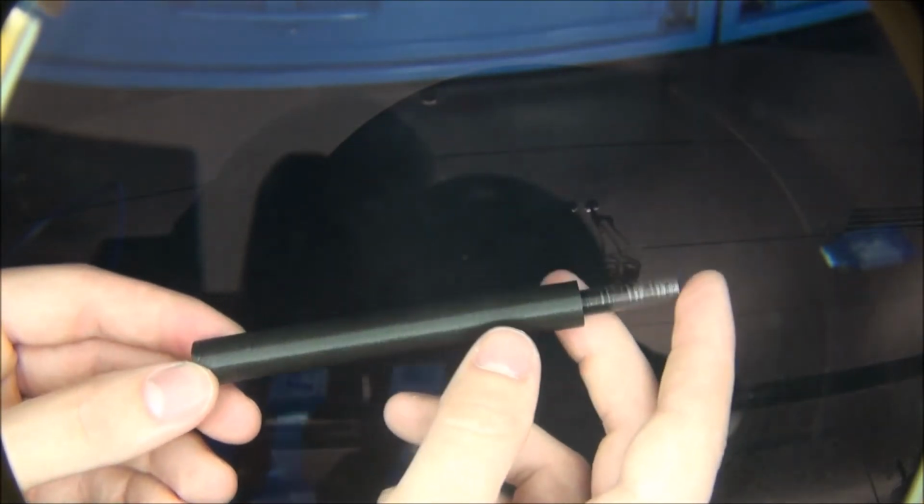So while this one does have a better circular form to it, and it might be a higher precision, it's not going to be as powerful as an auger, which in this case it probably didn't matter. But it's very important to consider that when you're trying to design a part to have a load-bearing aspect to it.